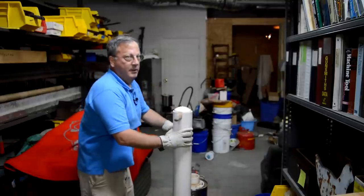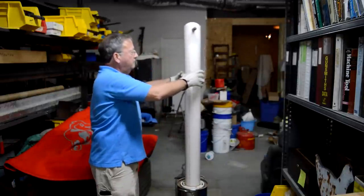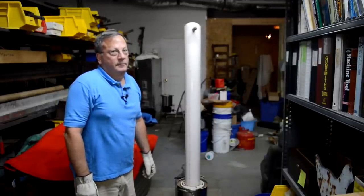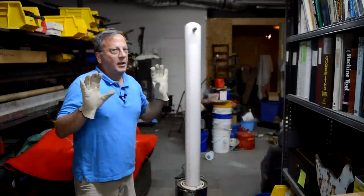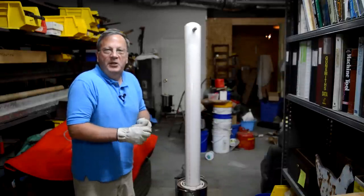There's two reasons for gloves, guys. One is you don't want to get oil on this action. Now, we've pretty much scrubbed it down, and when we get it hot this time, the oil will come off. And two, there's a lot of latent heat of vaporization in that steam, and you better respect the fact that a steam burn is nasty, because when it gets on you, it just keeps on. Gloves are a must. Leather gloves are a must. All right, we're going to let that cook for about 10 minutes and come back to you.